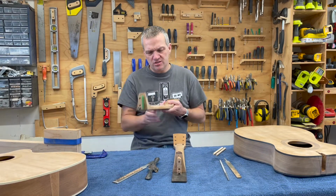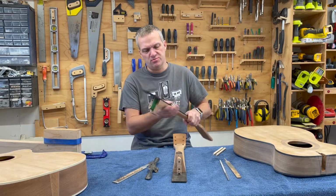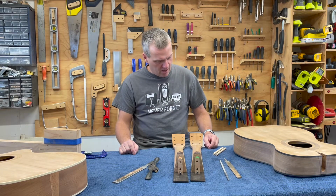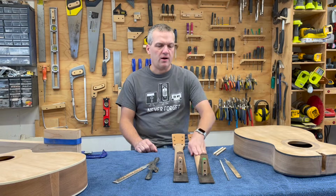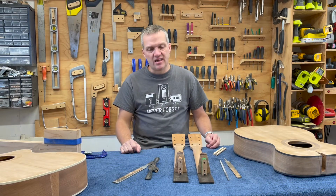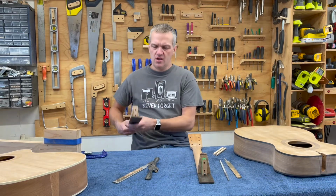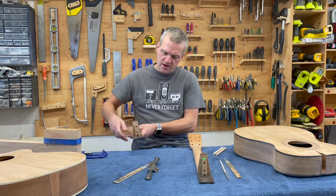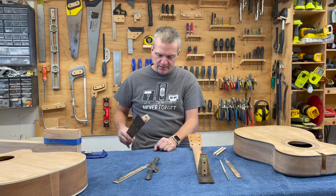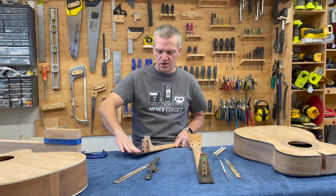Again, maybe just a little bit of sanding still needed, but it's already pretty smooth actually. Maybe just a little wipe sand with a really fine grit paper before I do the finishing. But right now I'm done with those necks. Next step, I'm going to attach the necks to the bodies, gluing this little tongue here, but not the actual tenon, because this is a bolt-on tenon and mortise. So I'm going to bolt it to the inside of the guitars and just glue the tongue.